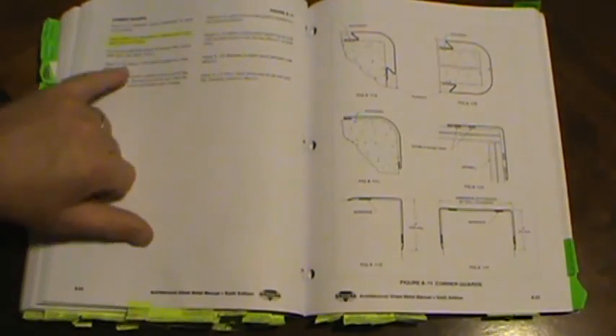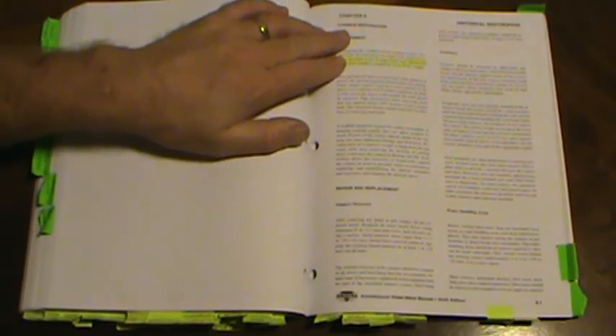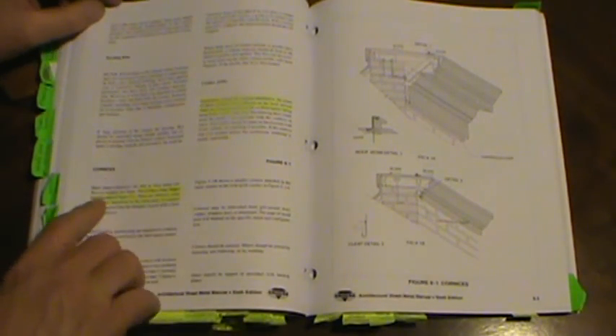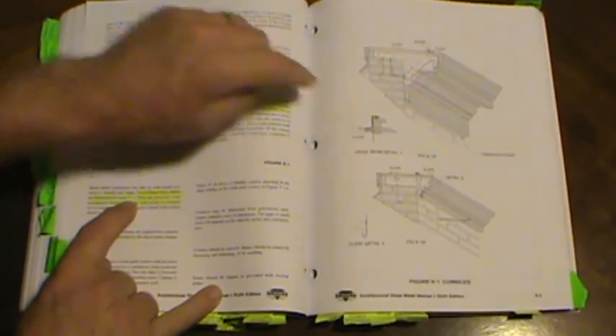Corner guards are fabricated of stainless steel, minimum 18 gauge. Cornice restoration in chapter 9: when assessing an existing cornice, typical cornices are made from 24-gauge galvanized steel, plain finish crimped, or 16-ounce to 20-ounce copper. Sheet metal contractors can form metal cornices to virtually any shape. During original installation, joints of cornices were soldered on the back surface while lying flat before being hung from the water table area. The exterior cornice is analogous to interior crown molding.